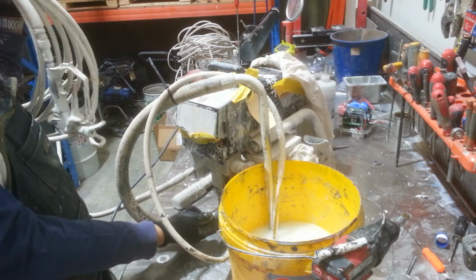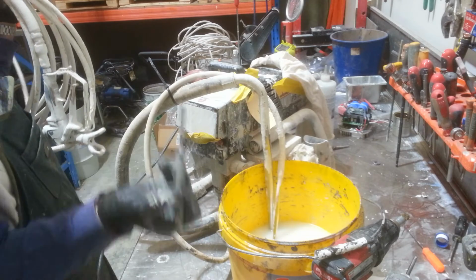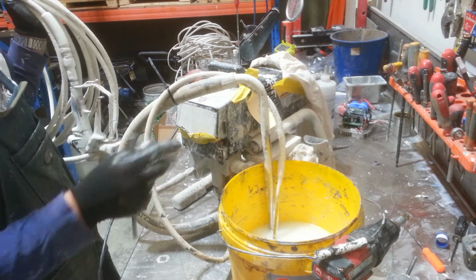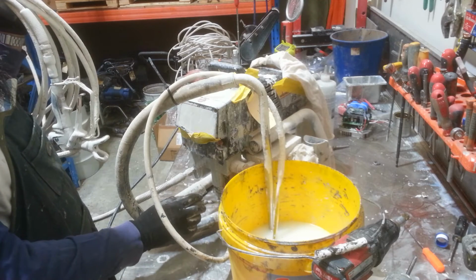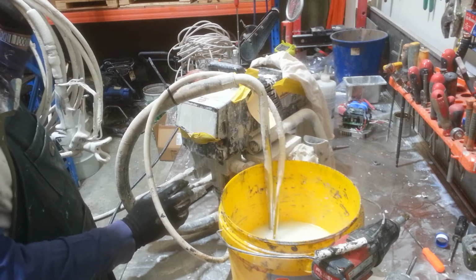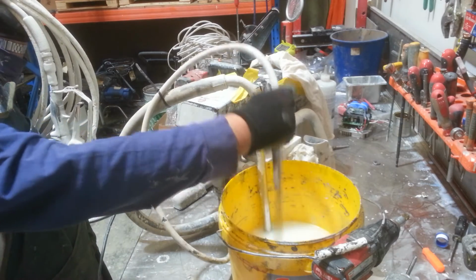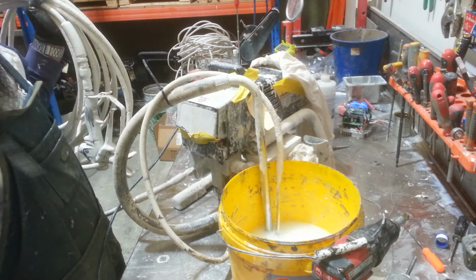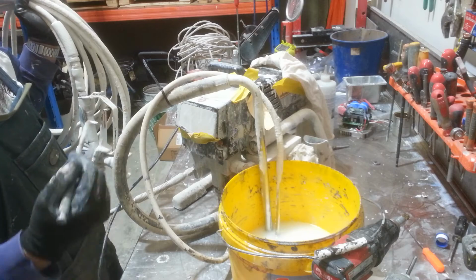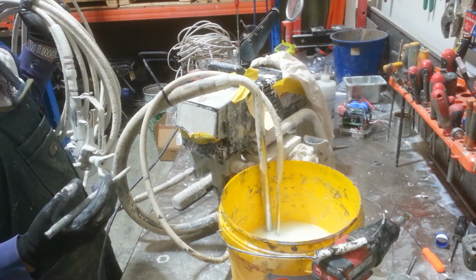So just to go back and check, first thing you do is check your inlet. Push on it very lightly. Do not push hard, because if you push hard, you're going to break the retainer and then you go from one thing to another. If the inlet is all good, all clean, you go to your outlet, which is the one that's inside the piston. The easy test is to pick up your return hose with the machine in prime and blow through it. If it blows through, you know that you have a blockage, you have to strip that and clean it. If it doesn't blow through, you know that it's all good and you should be able to reassemble it and test.